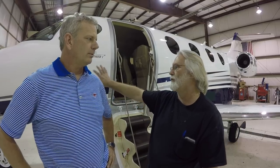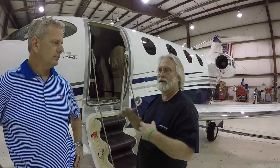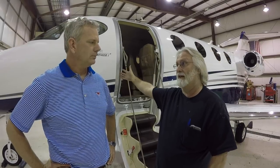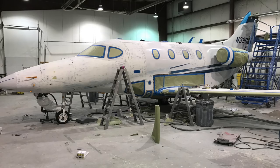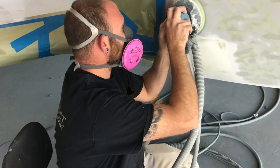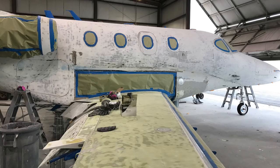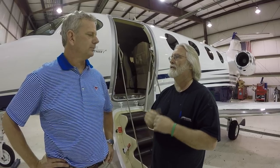The big thing is the whole tubular airframe is carbon fiber. A lot of shops are scared to death of carbon fiber because you can't put chemical stripper on it — if you do, you'll destroy it because it actually takes the resins out of the carbon fiber. So when we strip these, you mechanically strip it — the whole thing gets sanded by hand with a dual orbital sander. You take it down to the original primer as long as that's got good adhesion. If not, you go right to the composite base. So you're starting from scratch.